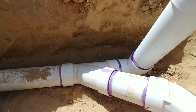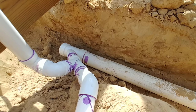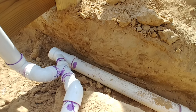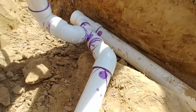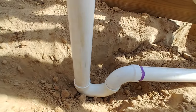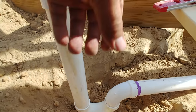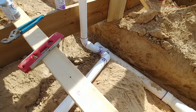From that Y you go into the main drain line. Over here for the shower I have a 3x3x2 Y, also at a 45, and then that 45 comes up to another 45 which follows along to my P-trap. This is actually the shower drain location — that will have to be cut off and the shower drain installed into it.